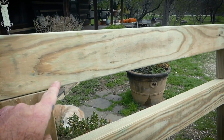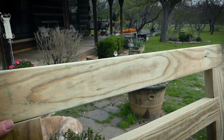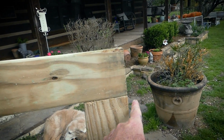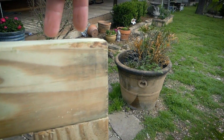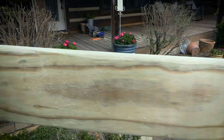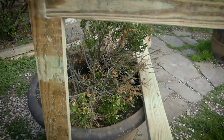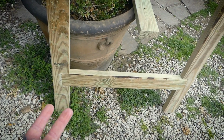Those ends are going to simply be put on. This is just laying up there right now. It looks like I did my math right. They're lining up edge to edge. We're going to put 2 ledger bolts through this direction. Same down here on this end, 2 more, and then we'll put that bottom piece on the same way.